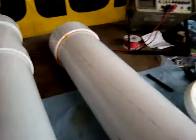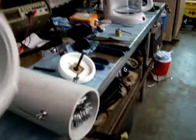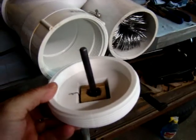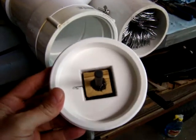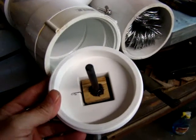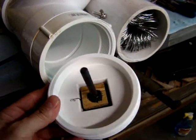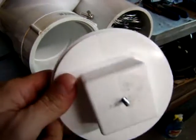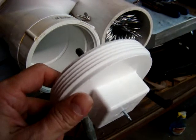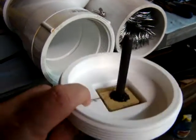The other end of the tee, where this clean-out is, is where this cap will go, and that's got my carbon rod. I've just got a little bit of silicone and a little puck of wood — it's part of a wooden stake you drive in the ground. I've drilled a hole and I've got a little screw poking out the back side of this thing that directly touches the carbon rod inside.